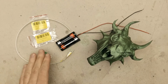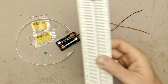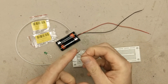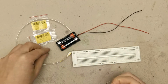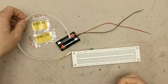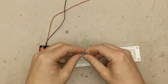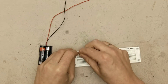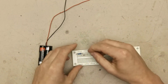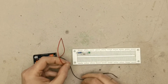But first things first, let's check if the LEDs are working. This is a breadboard. Those two resistors have combined the same value as those small resistors. And for the testing I will use this big LED, so I can put those aside. The connection is pretty straightforward — you just put in the resistors and the LED using the longer leg to the resistor.